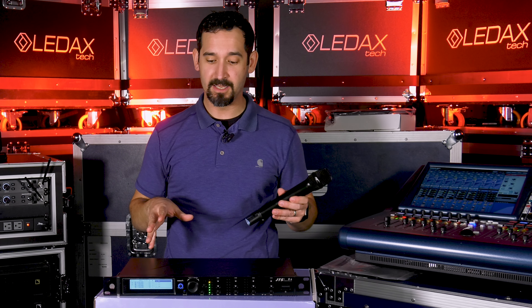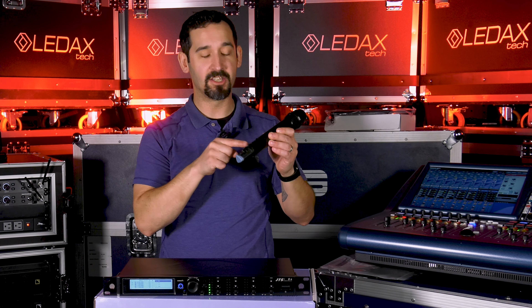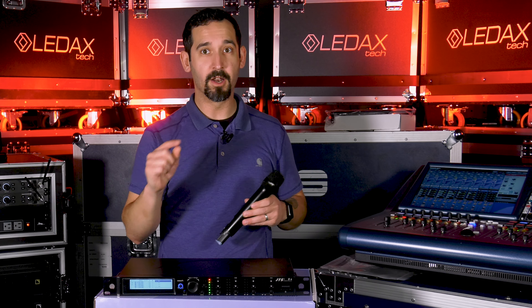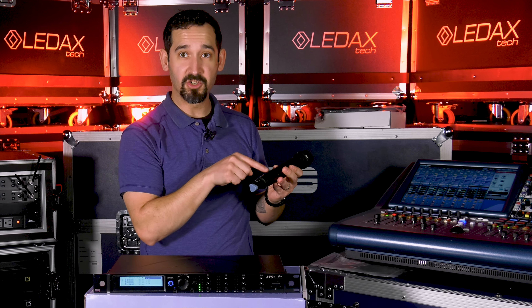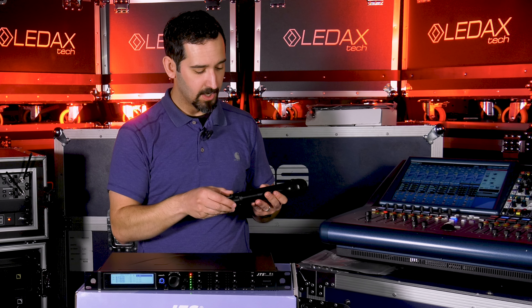The big thing here is that groups and channels are not the same as ID. ID is your Remo Set information. So if I have ID one, two, three, and four set on here, I need to have all of my mics set to unique IDs corresponding one, two, three, four. So if I want this to be channel one on my wireless system, I need to put channel one on ID one — which by default they're going to come one to four. This microphone I have here is already set to ID one. Keep in mind, if you set up a bunch of stuff on here and then you Remo Set it, the settings that are here are going to transmit to the mic, so you're going to have to do it again. It's better to set up the mic first.